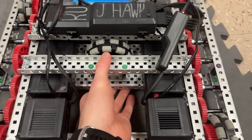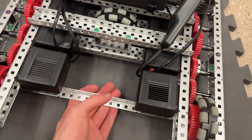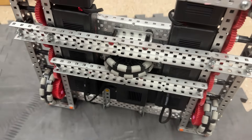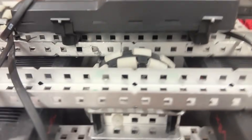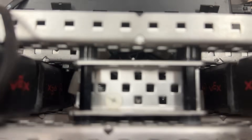It also adds a bunch of extra structure to your robot. This might be overbuilt — there's not really anyone else building H-drives to reference, but we just did like four C-channels, one of which was already a full-length cross brace. Then we have a smaller five-wide and another smaller five-wide in there. In order to mount it at a specific height, we used a two-wide inside there.